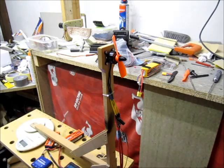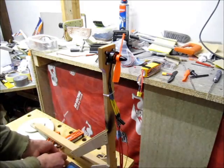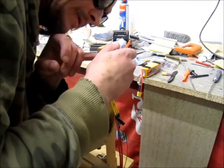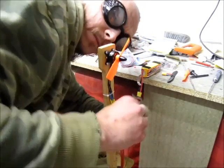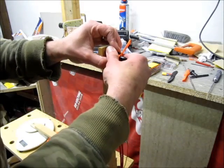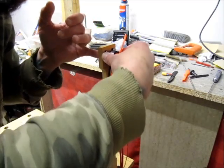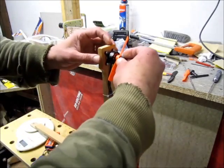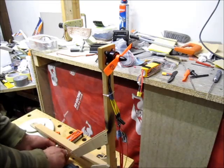I didn't go full throttle — it was nearly at full throttle — but I was pulling 20 amps and nearly 900 grams of thrust. There's a smell, probably just dust flying away. I'll disconnect before sticking my nose in there. The motor magnets are cool — well, warmish — but as I suspected, at the bearing part the base is a bit warm. Full throttle might do for a little burst. I'll try full throttle to see whether there are sync issues and how many amps I pull.